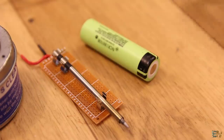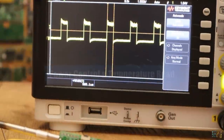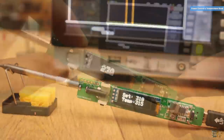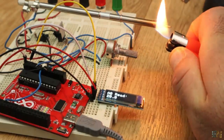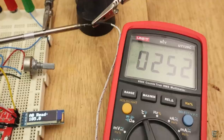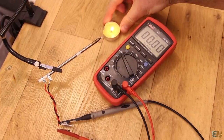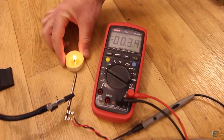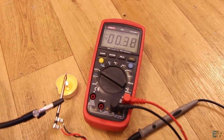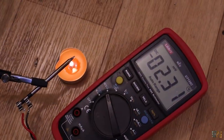For now let's say I go with this 5V soldering iron tip and the battery of 4.2V and a working setup of 7W. What else do we need? The power regulation and the temperature read. With the T12 I was able to regulate the power with a PWM signal because that's very easy to do, regulated according to the real temperature. To read the real temperature we need a thermocouple. The T12 tip has a thermocouple inside the ceramic heater in series with the heater. If we connect the terminals of the T12 to my multimeter and heat the tip with a candle, there is a voltage drop created on the terminals. Now testing the 5V tip - I connect it to my multimeter and yes, when I heat it up I get a voltage difference, so it must have a thermocouple inside.